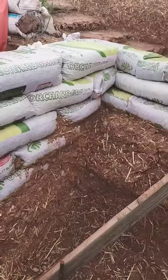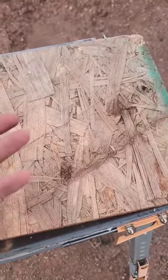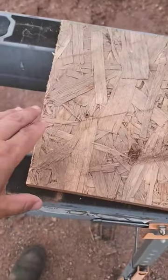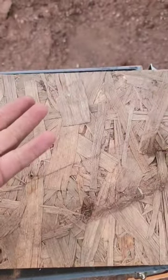Today I'm going to show you how to make and use cleats for earth bag building. You'll want to start out with some flat lumber. I'm starting out with some OSB, but you could use plywood or pallet wood, whatever you've got handy. I've cut my particular board at 12 inches by 12 inches, but you can make yours wider or longer for whatever your needs are.